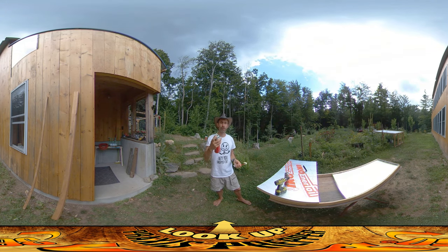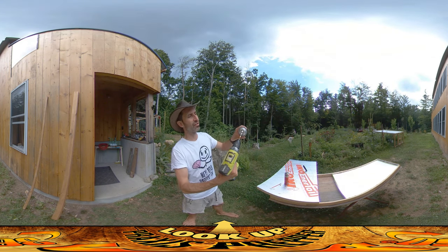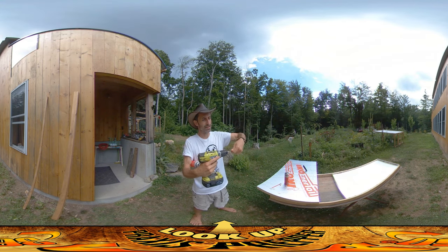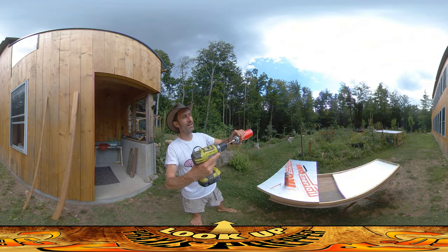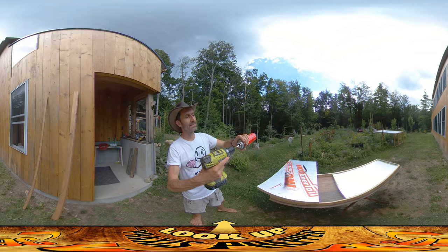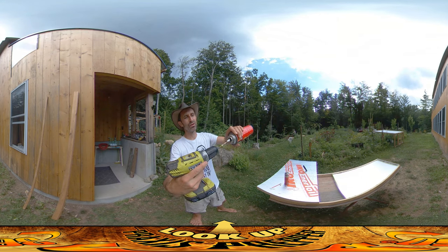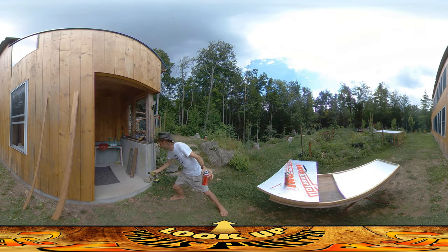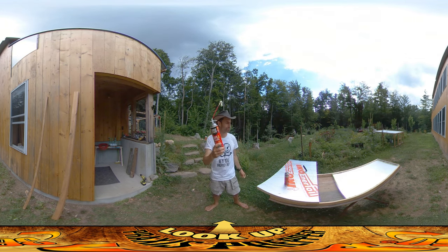This is specifically about unclogging the can. If you've got the can and it is cured right in there, you just take a little drill bit that is just slightly smaller than the hole size — and you can see I already did it, it's got some spray foam on the end here. You just put the drill bit in and very lightly, you'll feel there's like a little plastic something at the bottom there. You'll feel that you're drilling through this stuff, and that's really it. I just unclogged it again. At least two times in a row for me, every single time I've tried it, it completely unclogs the can.